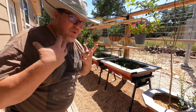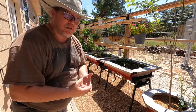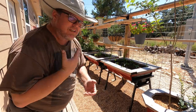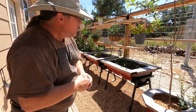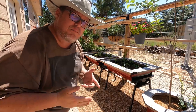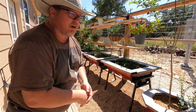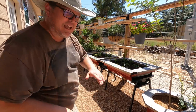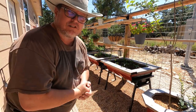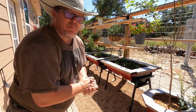Again, this is a really simple project. Getting pegs into the fence post and then using a seesaw to balance it out. So now you can just buy 2x8 or whatever will fit in between the posts and set them on the seesaw and go from there, and it will still be a consistent line all the way across because it's anchored to those seesaws.